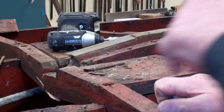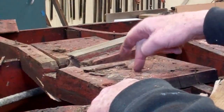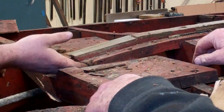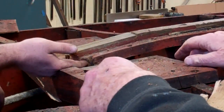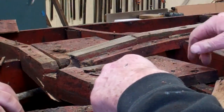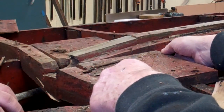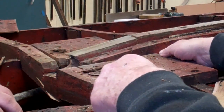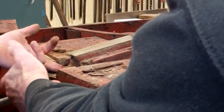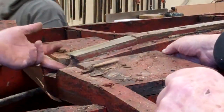I understand Chris Craft's problem. In our dreams, the keel would pass over the top of these planks and we could run a single plank all the way across. But there's no clearance to do that, even once we repair this. So we'll put them back in new blocks the way Chris Craft did, and we also want to run a couple of fasteners this way to stabilize these guys.